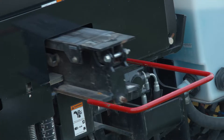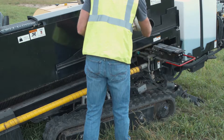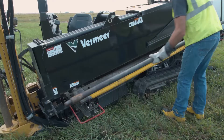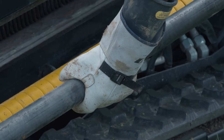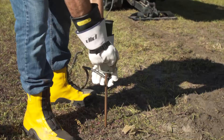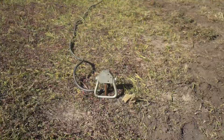Other crew members need to wear hearing protection, hard hat, safety glasses, and electrically insulated safety boots when working close to the drill and/or support equipment. Anyone standing on the ground and touching the drill while drilling must wear electrically insulated gloves and electrically insulated safety boots. This includes any personnel loading or unloading drill rods. The ground may become electrically charged if a strike occurs. When placing the voltage stake in the ground, wear both electrically insulated safety boots and electrically insulated gloves.